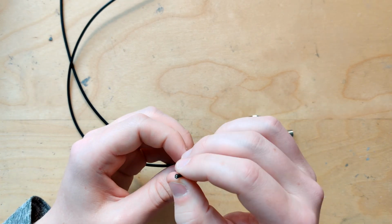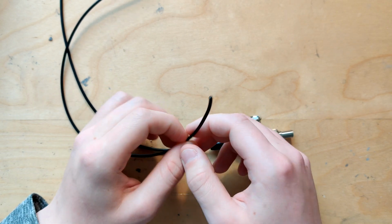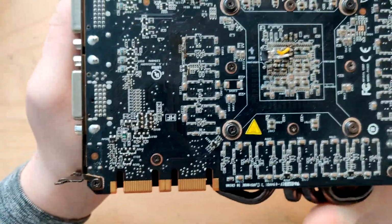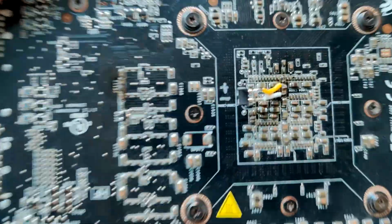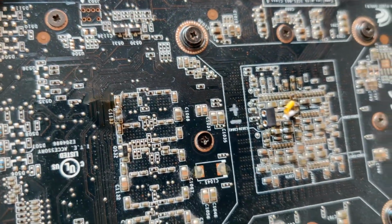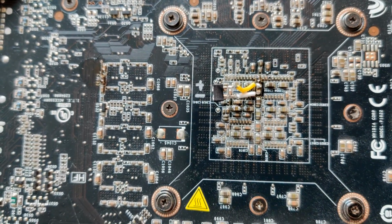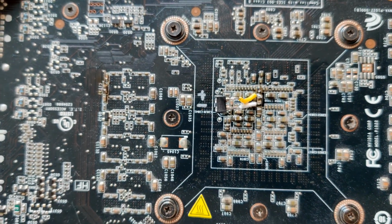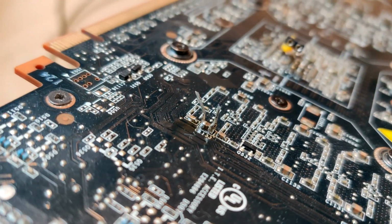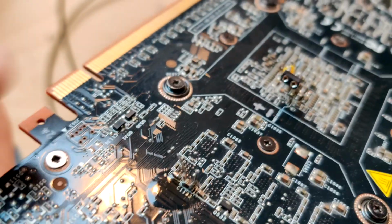But anyway, the kind of probe that we're going to be building is also going to have an advantage in how it hooks up, which I can show on this 480 because it has both styles of hookups. Now this is gonna be the new style of hookup that I'm gonna build. This is basically a little pin connector that we're gonna be plugging into, with a few short wires just connected to a resistor, capacitor behind the core. And this right here is what I used before, which is basically just 2 capacitor legs that the clip would clip onto. And this is not great.